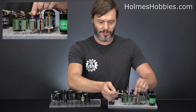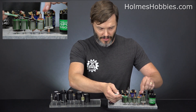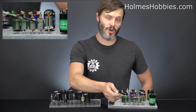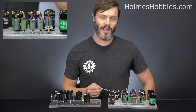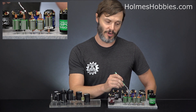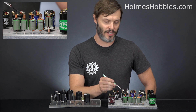We also balance with epoxy instead of removing material from the armature. You can see on the machine-wound versions where they actually take material away from those armatures — that affects performance, it takes away torque, efficiency, and makes startup a little bit more unpredictable. So for our pro hand-wound motors, we always go with epoxy balancing. It's by far the most predictable and best performing for the task.